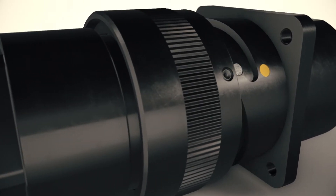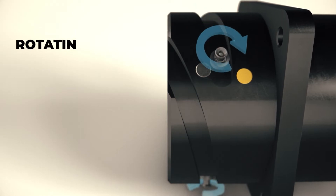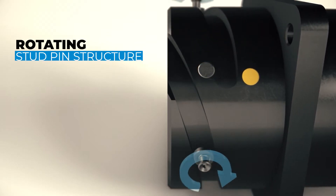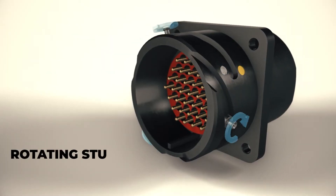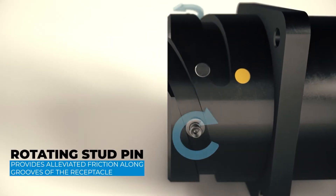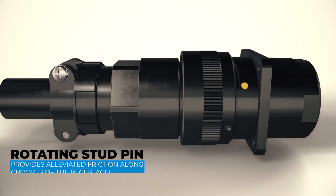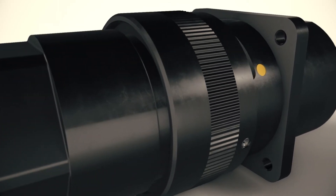As you can see here, the JKO6 has a stud pin structure on the plug side, which rotates as it is guided through the grooves of the accompanying bayonet style receptacle. This rotating stud pin provides two benefits. First being the alleviated friction — by having a stud pin that rotates, you'll find the connector effortlessly able to mate and unmate with very little friction as the stud pin is guided through the groove of the receptacle.